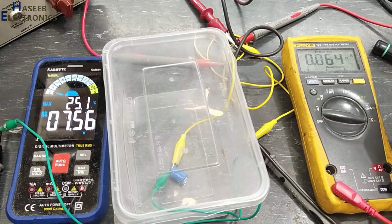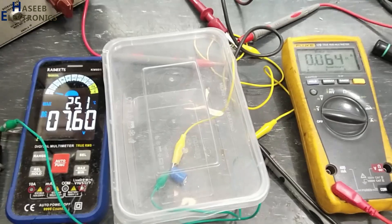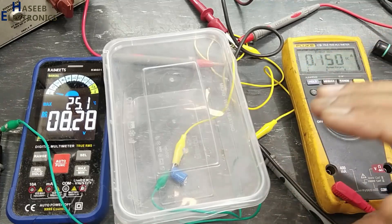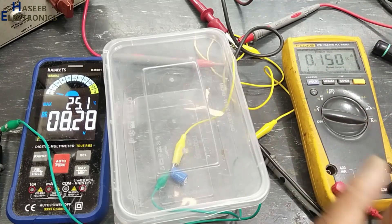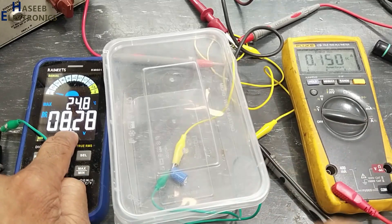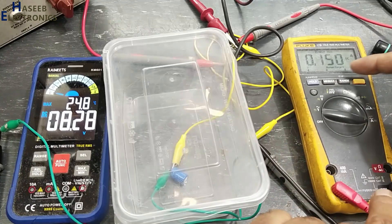The current is now 40 milliampere. The 16 volt capacitor is making short circuit at just only 7.5 volt. Now 64 milliampere current is flowing. At 8.2 volt we can see the current is increasing. In good polarity it started to draw over-current at 26 volt, but in reverse polarity at just half the voltage it already started leakage current, and it is too much leakage current.